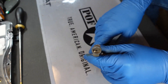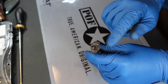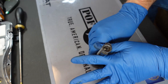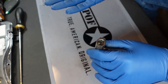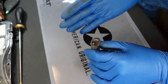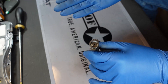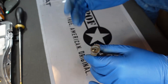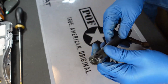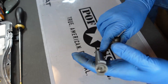Now, there is one thing I wanted to add to this, and that is that if you live in a dry climate, you're likely never to run into this problem with that plunger. If you live in coastal United States — coastal anywhere — and you're around a lot of water, and you find that in the summertime when it's hot, if anything you're carrying like your glasses fog up, then there's a good chance that you can have a problem with humidity getting parts wet in your gun. Most places are pretty dry, and you don't have that problem, so for the most part you really won't have to worry about this.